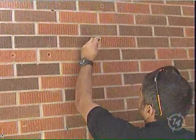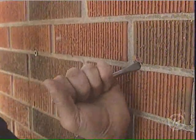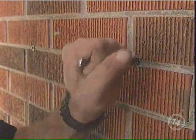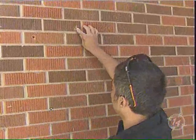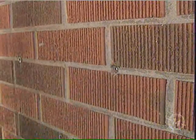You want to get it on there. The point is, you want to break off the edges — bang it and bang it — get it in at least a half an inch. We're going to be parging it or tuck pointing it, so to speak. Now we have gray mortar and red mortar.